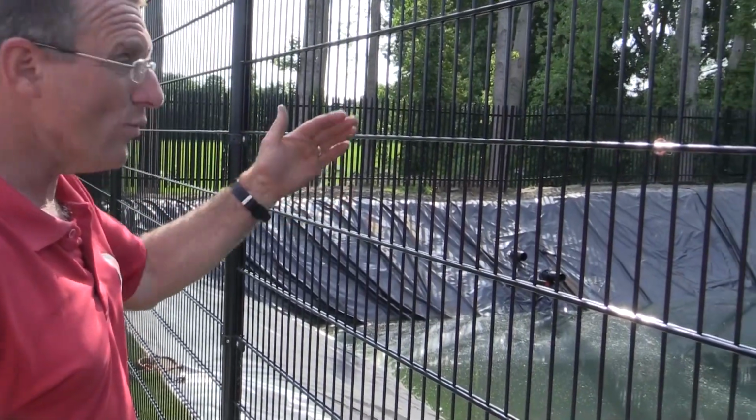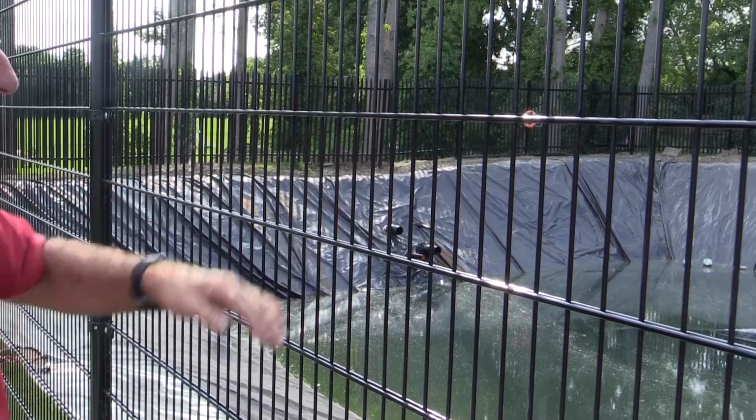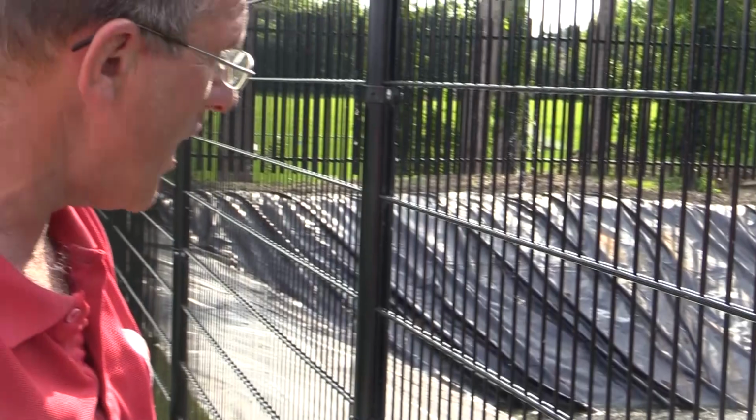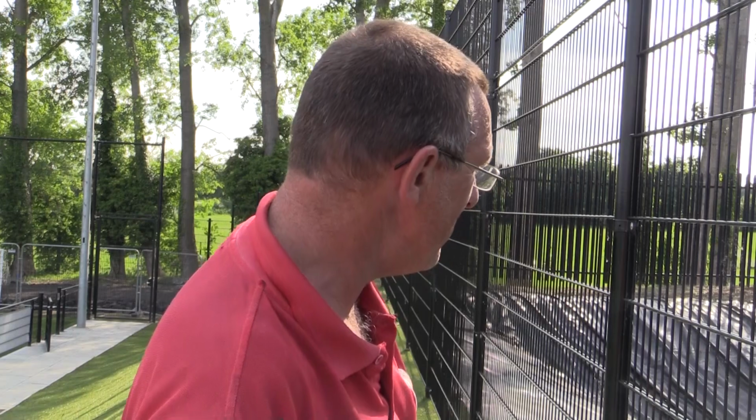That's collecting groundwater and draining out from the opposite side of the lake, where we do have a high groundwater problem at times at the training ground, especially higher up. So up this end of the site, we're still draining down the bank from that side, and that's continued to discharge. So the one to the left, that's the return from the pump station, which is the closest, and that will, when the drainage water reaches that point, then it gets pumped up to the lake. So it goes from pump 2, which is at the bottom gate, to the next pump station up, which is pump number 1, because that was the way that they were put in, and then returns it to the lake. And the 2 pipes are inactive below that at the bottom. That's irrigation in and out and irrigation return.